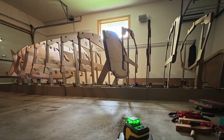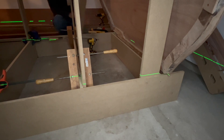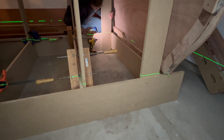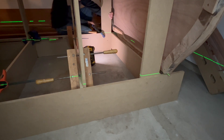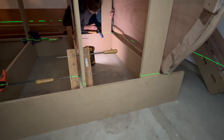The first step is to find a position for your laser level where it will intersect with the majority of the frames. For no particular reason I started with the transom legs. The key here is to align the green laser level line to the black pencil line on the board. While easy to see the laser line in the dark, I need a flashlight to see my pencil line, and then I temporarily position it with a clamp.